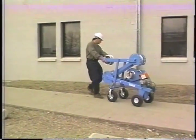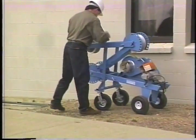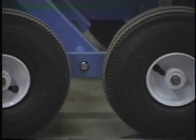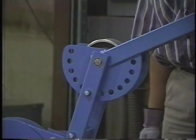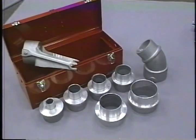All Condux pullers offer self-contained versatility. Condux pullers are mounted on sturdy steel frames that feature four pneumatic tires. These wheels provide improved mobility and greater stability. Orientation of the puller arms are easily changed and set with adjustable pins. Four specific conduit adapters come standard with all pullers. Additional adapters, including a 45-degree adapter for pulling in tight quarters, are available.